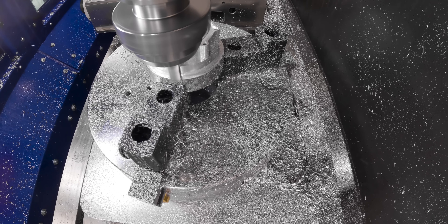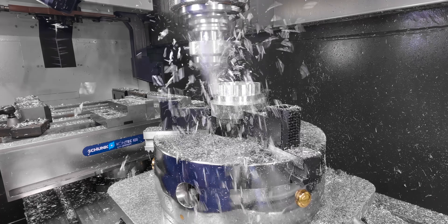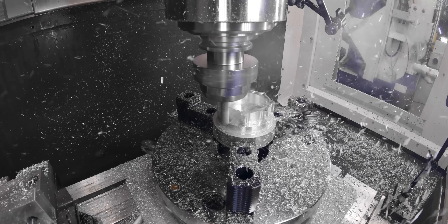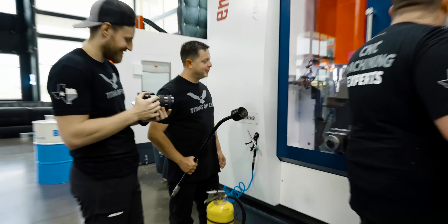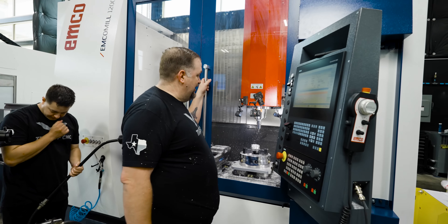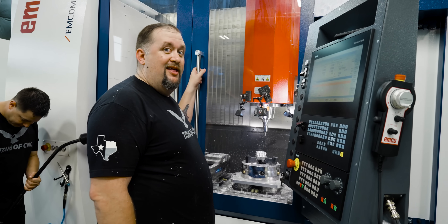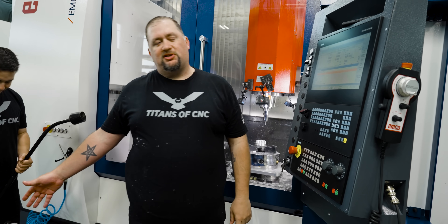You can see we're making chips so light they're actually floating in the air. That's an additional level of hazard because now we have powdered magnesium where if it ignites it's going to cause a flash fire. If you have a class D fire extinguisher that's great, but if you don't know how to use it that's not so great. So make sure you familiarize yourself with your fire suppression equipment.